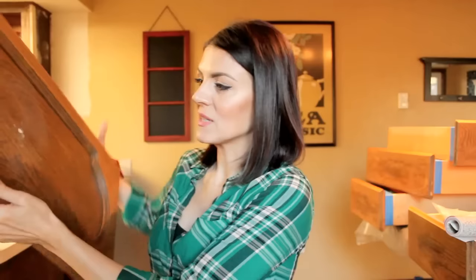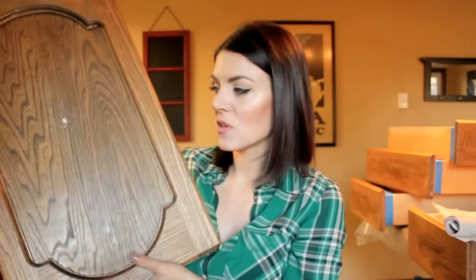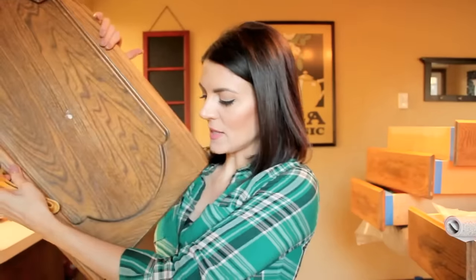If you want to change the style of your drawers, like if you have handles on your drawers, you can go ahead and fill those in at this time too. But as you can see, it's not glossy anymore. That deglosser has removed all of the gloss, and that's what you want, because then your bonder is really going to stick to that. Another thing I wanted to mention that didn't come with the kit is this little scrubber. It's a little plastic brush. This works really great for getting into the little crevices